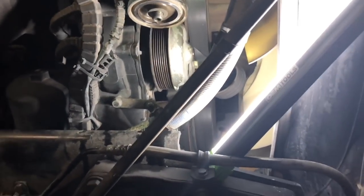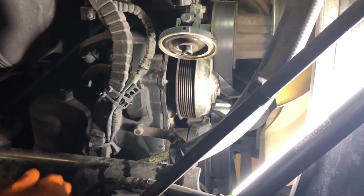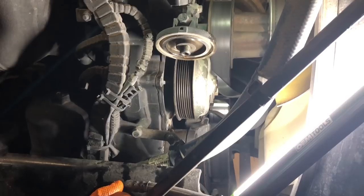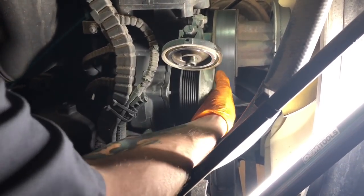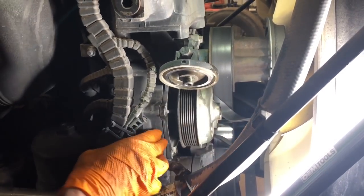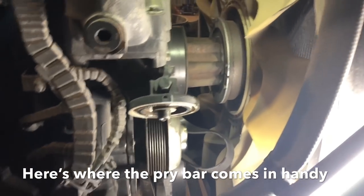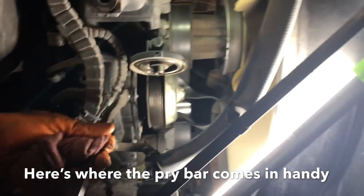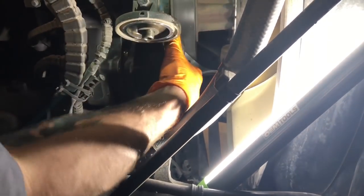Alright, we got all five bolts out. Now there's no piping, no hoses, nothing you have to worry about on a Paccar other than pulling the five bolts off and making that bad boy out of there. It'll take a little bit of nudging and bumping and it should be right off. Broke loose there. And there she is guys - it's that simple.